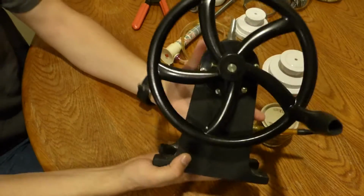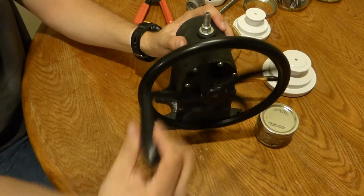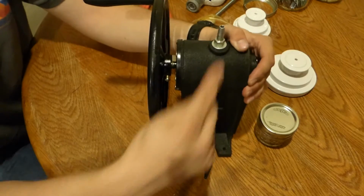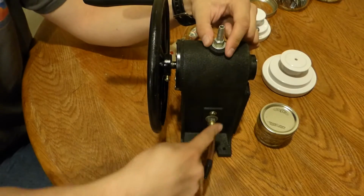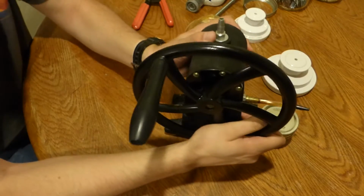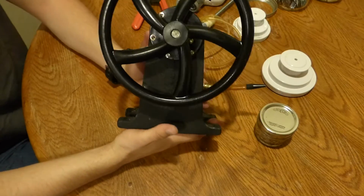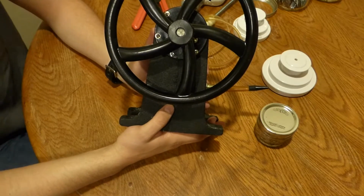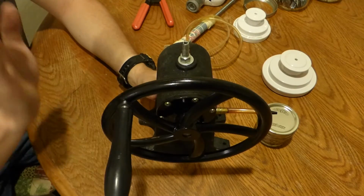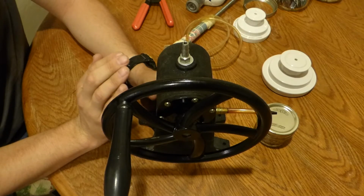So I went and got this guy. This is a hand crank vacuum pump. It's pretty cool actually, because it sucks in on this side and outputs on this side, so you can apply pressure or apply a vacuum depending on which side you hook it up to. This guy is expensive though. It costs about $100. This was intended for teachers in a classroom to teach their students about how vacuums work. This guy was good because it is really fast, but I don't find it to be as nice as the next part, which is the pump and seal.